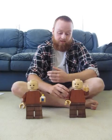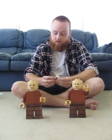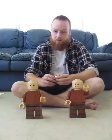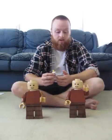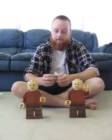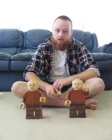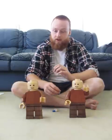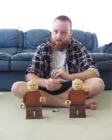What they are is a full-scale replica of one of our favourite toys, Lego. So what I've done is I've used the original designs of these men and scaled them up to a scale of 1 to 6.25 and created them out of timber. What I've used is Huon Pine, Australian Red Cedar and American Walnut. These are soft timbers, so they're quite suitable for a project like this where you've got to have free moving joints that are tight but you still have the ability to move them.